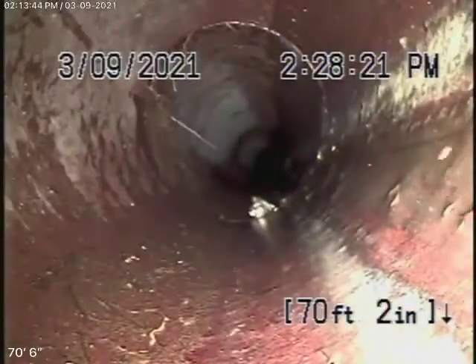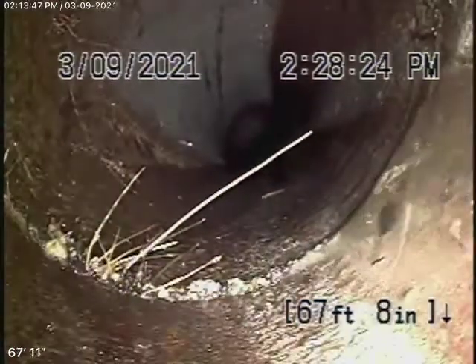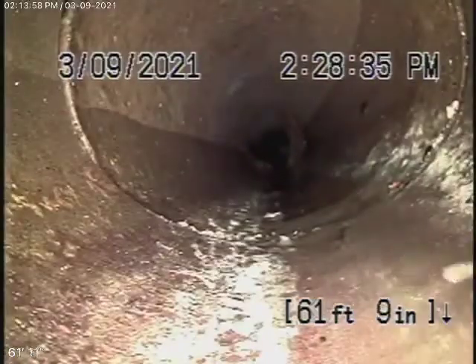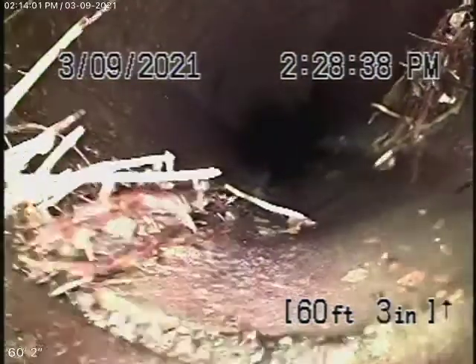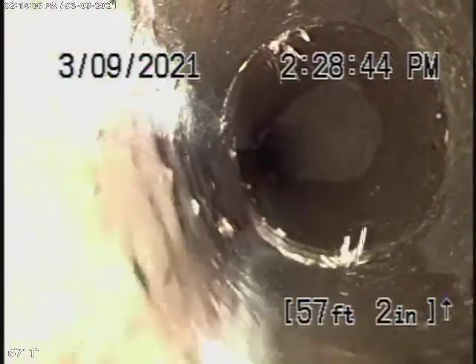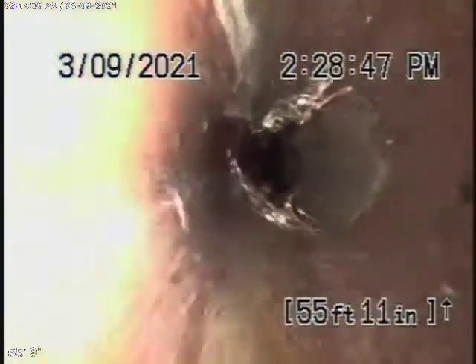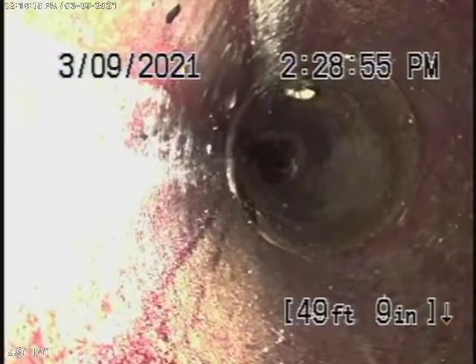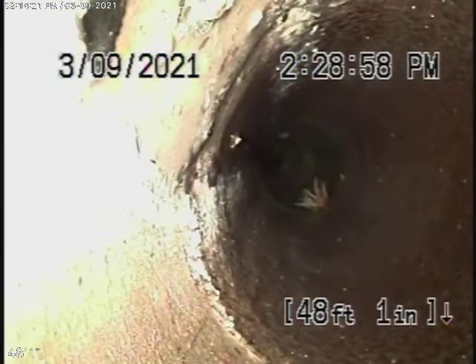Quite clear. Very minor roots so far, very minor cracks. This is what it looks like in a clay pipe — a little bit of roots coming through the joints. It's very common to have that, especially in an older house like this. On the whole it looks pretty fair, fully functioning, no breaks or anything so far. This is all running in the backyard — it goes all the way to a city easement, which is actually a good thing.